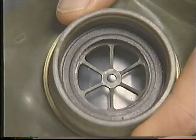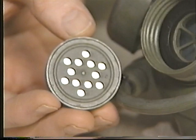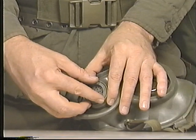Check to be sure the rubber washer remains in the mount. Reinstall the side speech transmitter into the opposite side mount. Ensure that the visible amber membrane of the transmitter faces the inside and the protected side faces the outside. Replace the retaining ring and tighten it by turning it clockwise using the conversion tool.